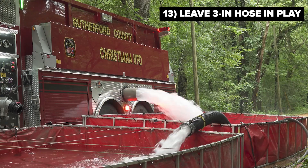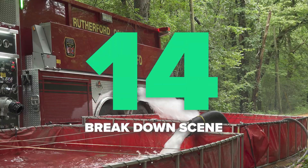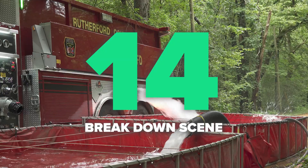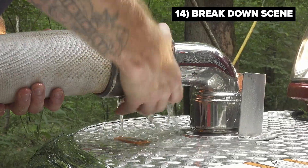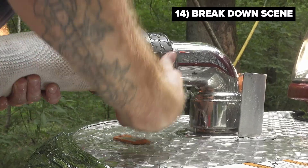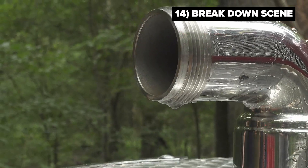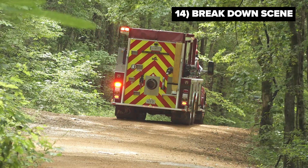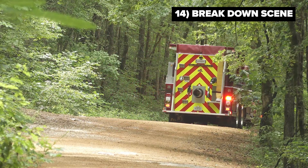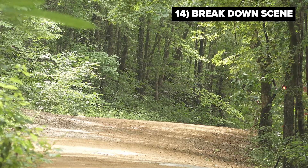One more advantage of utilizing the rural hitch and the jumbo clappered Siamese is that as the fire incident starts to decline — meaning the fire has been brought under control and fewer resources are needed — the same way we built the system from a small flow event at 500 to 600 gallons per minute upward, we can start to de-escalate: breaking down the frame tanks, possibly taking the dump site engine out of play, getting those companies secured and back to headquarters, where we go back to the traditional rural hitch nursing operation.